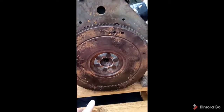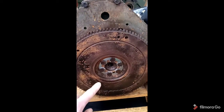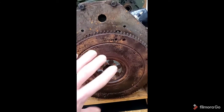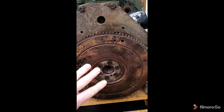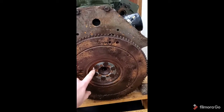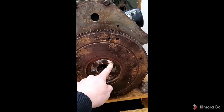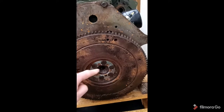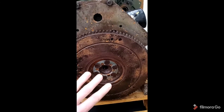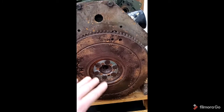So the flywheel itself then, what it includes is, underneath there's an oil seal retaining plate, with about 4 bolts in it. That helps keep pressure on the oil seal, thus making a good seal. So that's gone on already. Like the flywheel retaining plate, it has these bend over tabs that are slightly pre-bent. They can be a bit of an arse to get to, but they need folding over to retain the oil plate. I've taken lots of these engines apart, and the plates have been put on, but they haven't been folded, so they're not actually serving a purpose.